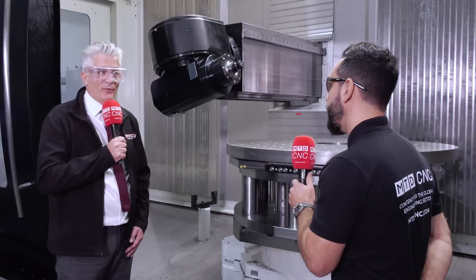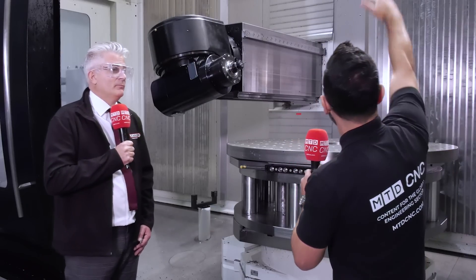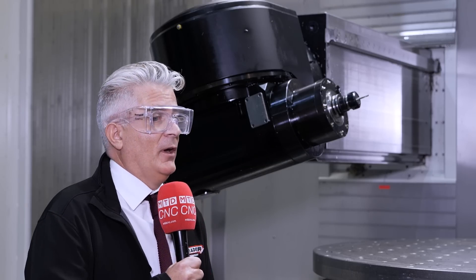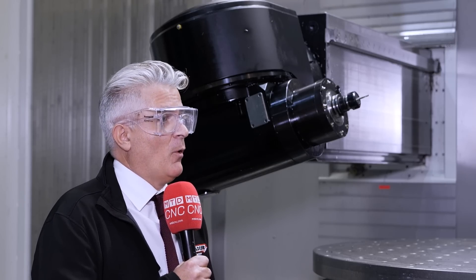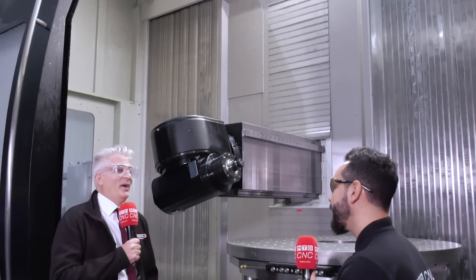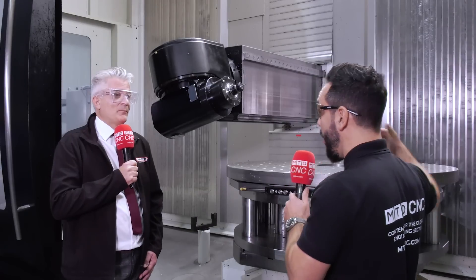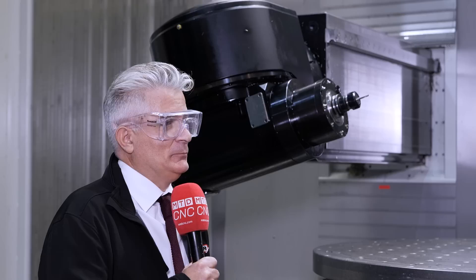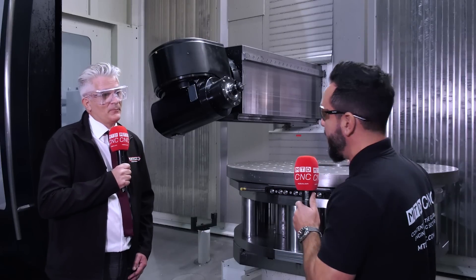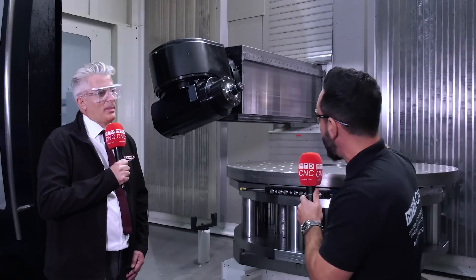That obviously dictates which side we machine from, but in all cases we have good clearance on the back of the machine. Height is another concern — originally we specified a much smaller machine, which we call the Shark 1, but as in many cases there was a last-minute change of design for a new job and we had to extend it up to 1600 millimeters, so we went for the bigger Shark design. The maximum weight we can index is three and a half thousand kilograms.